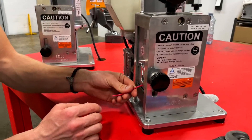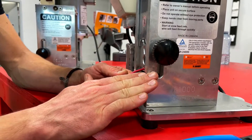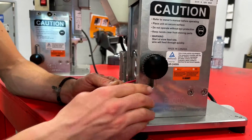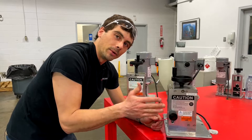Now that your knife is touched off you can get your wire guide set to the correct position. What you want to do is have a 15 degree angle going in. Next, put a little bit of pressure on top and tighten it down. What this does is it holds tension on the cable as you're stripping, which prevents it from slipping out of the track.